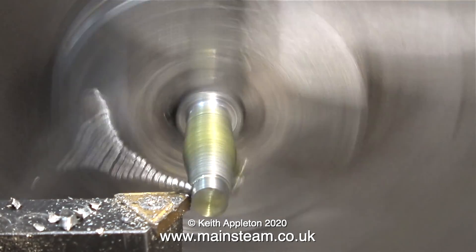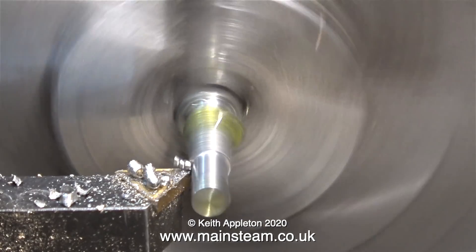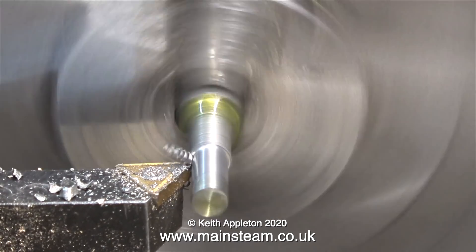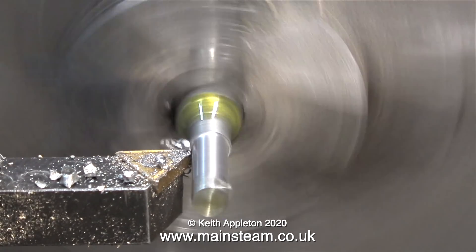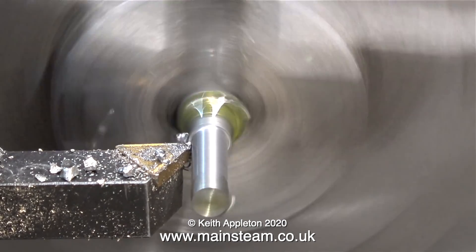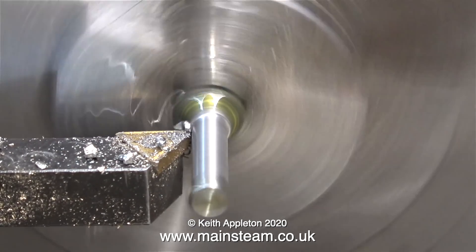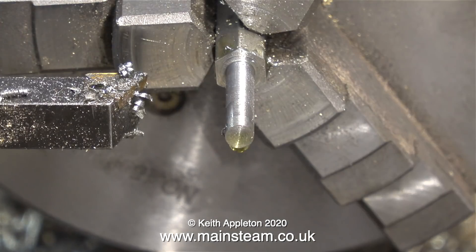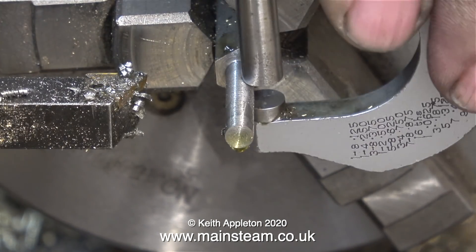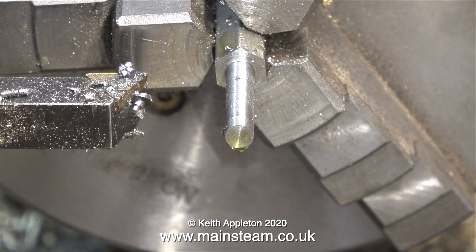This is a much finer cut and I'm also using some oil. It would really be better to turn this piece of steel at a higher speed, but it's difficult to change the speed on my lathe and it hurts my back kneeling down to move the drive belt onto a different pulley. So I will live with this speed — it should be alright. This clip shows how much better the finish is on the work, and just one even finer cut made it even better and the right size.